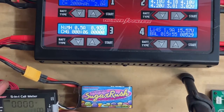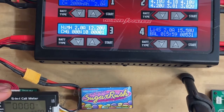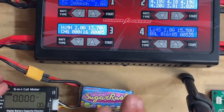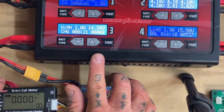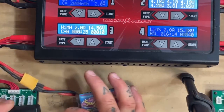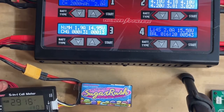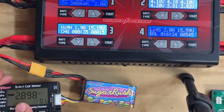What we're going to do is watch this meter and see if it kicks in — and all of a sudden, there it is. Now let's watch what happens. We're going to switch to the cells and just let this thing start going and see what happens. Give it a second. So far we're getting a voltage reading back of 14 volts. Let's just give it a little bit. Now unplug this and plug it back in, and all of a sudden look — we have cell one, cell two, cell three, cell four, cell five. And now we're getting readings.